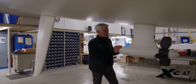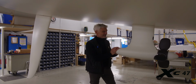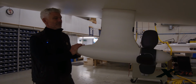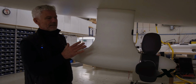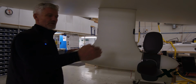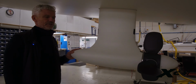So, Stuart, I'm sure you're going to tease me now. You claimed that we turned the sail drive the wrong way around here, and it looks like it, but it's actually because this particular boat is electric driven. So this is the drive that Ocean Volt developed that not only drives the boat when the propeller is running around, but it also gives the opportunity with these pitchable plates to generate or charge the batteries while sailing.